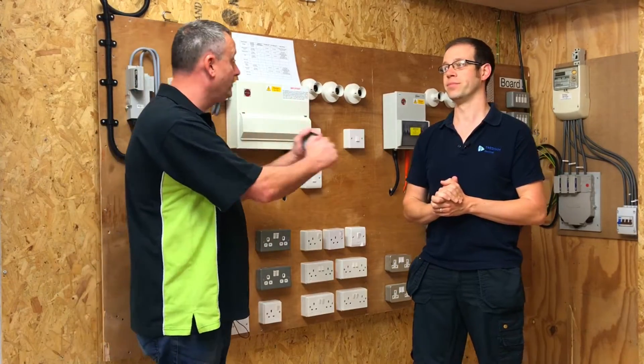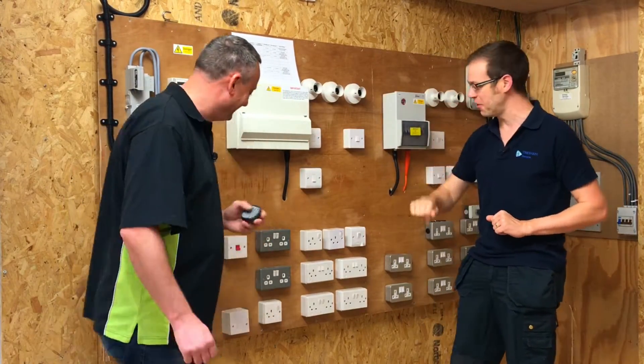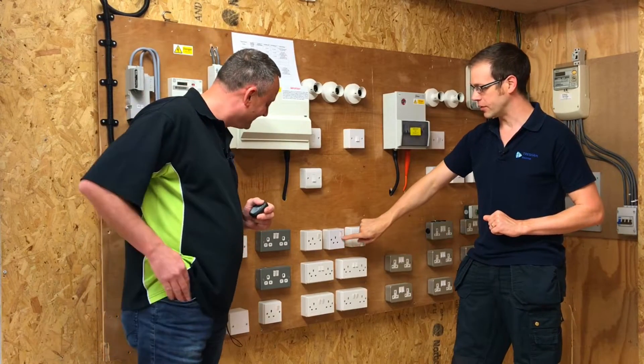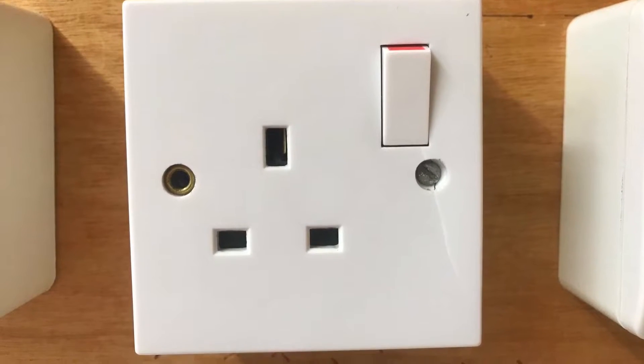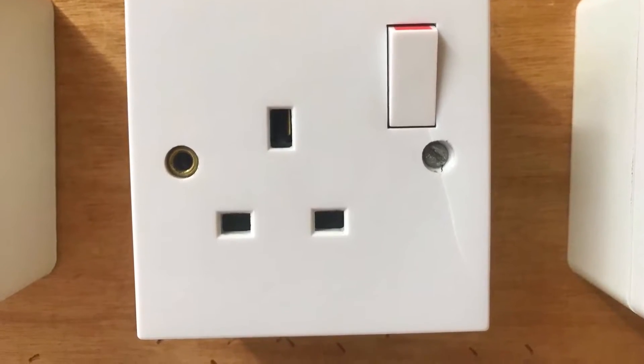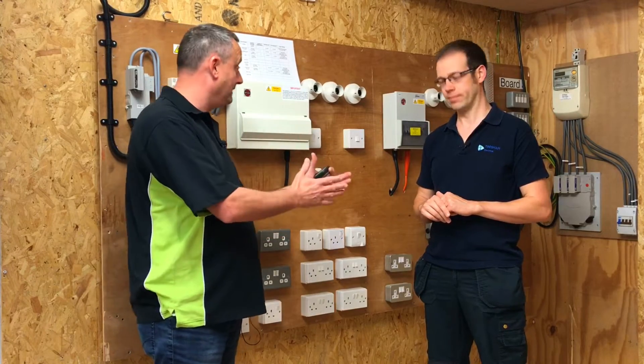Equipment identified - Joe spoke to Gary as the property owner. There's a socket here with a crack across the fixing screw where a heavy-handed learner put it back with a little too much force. We want to replace that. So we've identified the equipment that requires isolation - that's the first part of the process.